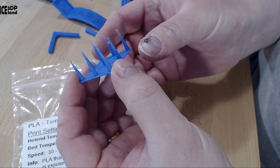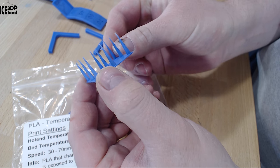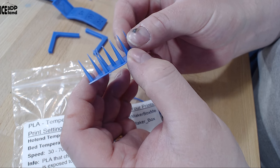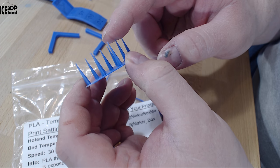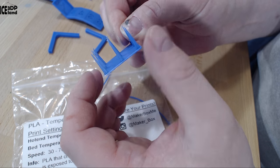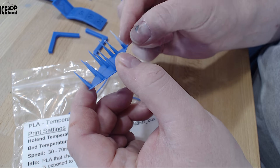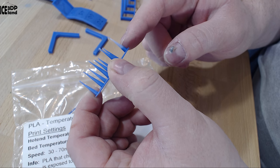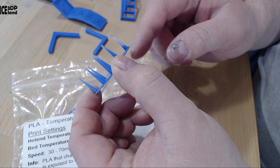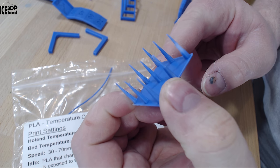Here's a retraction test I did first and it was coming out excellent. I had a tiny amount of stringing at the topmost part but nothing too serious — it was working quite well. I'm holding one strand here to heat it up and you can see how heat affects the plastic. It changes colors — quite a funny effect.